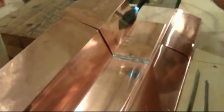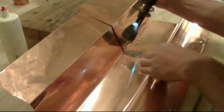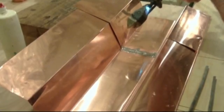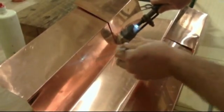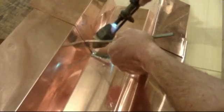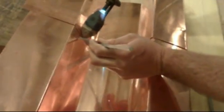Normally what I like to do is start by getting the two pieces of metal a little bit closer together. We'll heat this up and tack it in a couple of places. It's important to get the two pieces of metal tight. If there's a bulge or any buildup, it's virtually impossible to bridge the two sides.